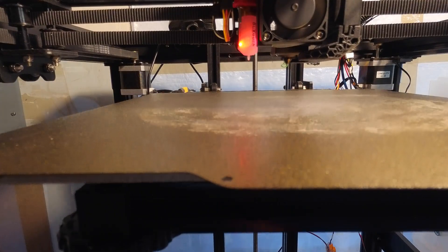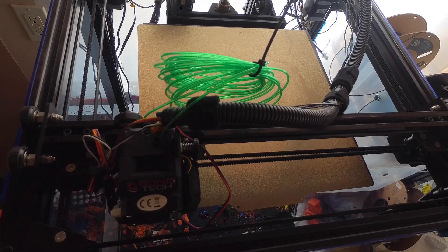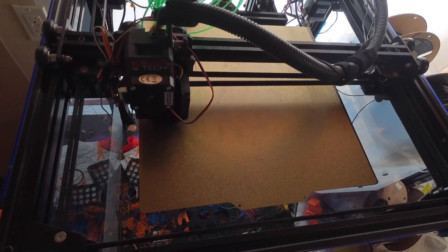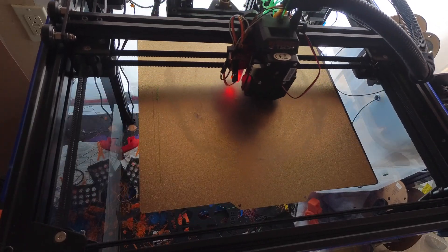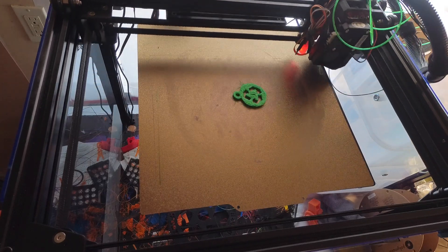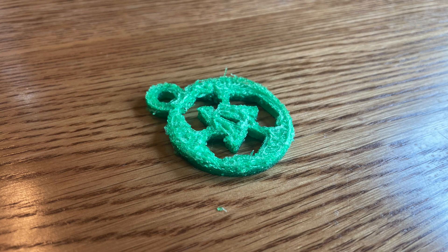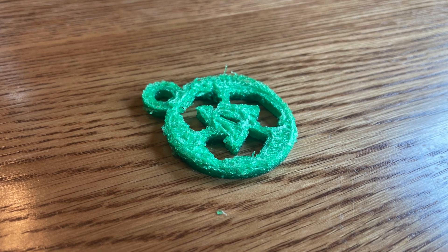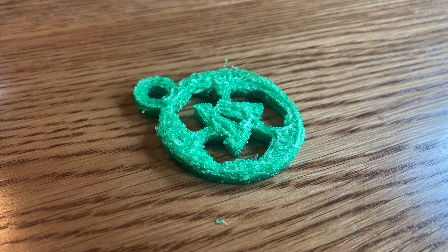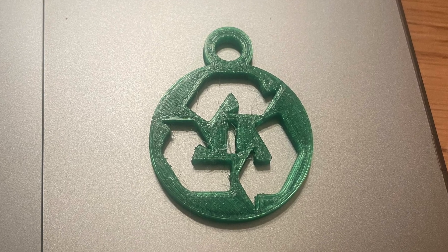Once dry, it can be used in any 3D printer that can print PETG. PET is very similar to PETG, however PET does not have the additive glycol, which is what makes PETG more flexible and easier to run through a 3D printer. Here I'm printing a small keychain on my Creality Ender 6 — I can print two of these keychains out of one bottle. This first sample is an example of what happens if you don't dry the filament before use: the water becomes steam as the filament melts and it forms a brittle foam. This was printed with dry filament and it's a lot cleaner.